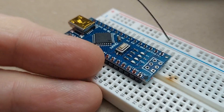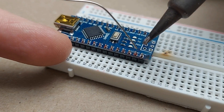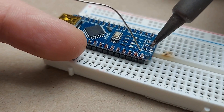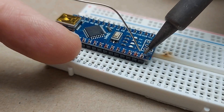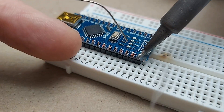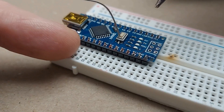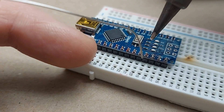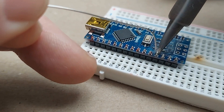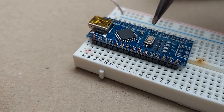Now I'm ready to bring in my soldering iron and solder. I want to only heat up this board as briefly as I can, so the rule of thumb is count to three and everything should melt. You're always going to use the iron to heat the component, and the component is what melts the solder. It's really hard to do on camera since narrating slows me down, so I'm just going to go down the rest of this row without narrating the whole thing.